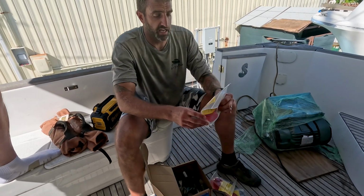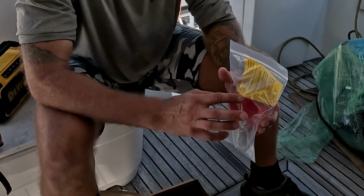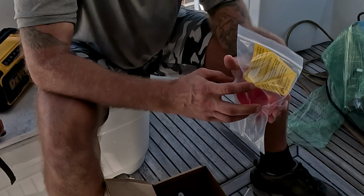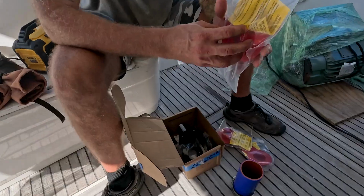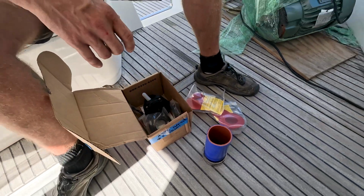You take these little guys, these are to protect the seal. You put that underneath the seal because it has a little bit of a loose fitting on the shaft. It doesn't actually get compressed until it goes into here. You put that on there, and you make sure that your shaft is nice and clean so there are no pits or anything that'll cut up the seal.